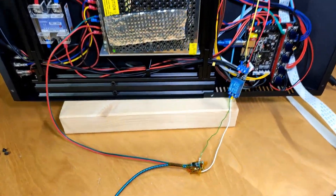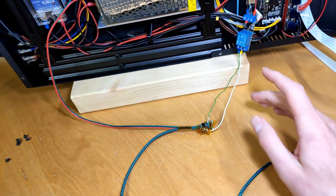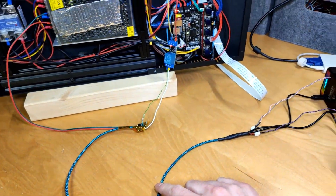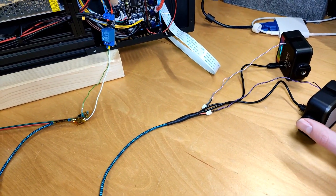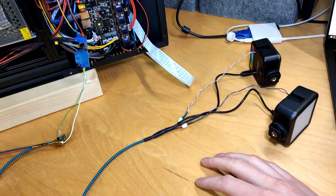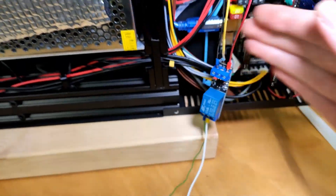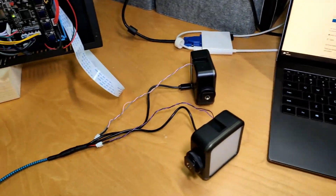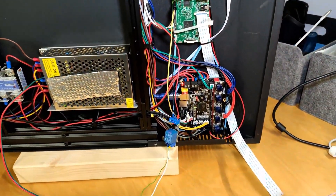Actually, we're not ready yet because I messed up a little. We do need both wires — what I forgot to take into account is that if you run two amps through a wire, you get some voltage drop, and the ground at the lights was 0.2 volts off from the ground at the Raspberry Pi, which made the whole thing unreliable. So I reverted to using a relay, but now everything works and we can control it all from the Octoprint interface — and as a bonus we have a nice clicky sound from the relay. It's a long night, but I'm happy.